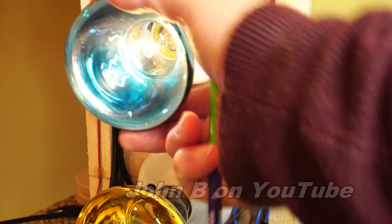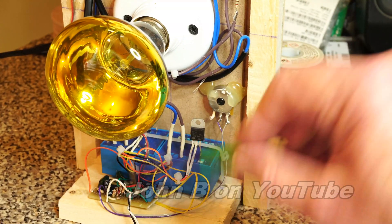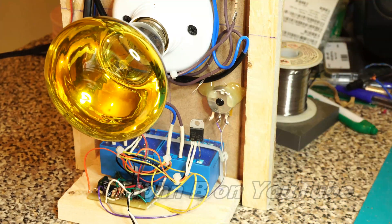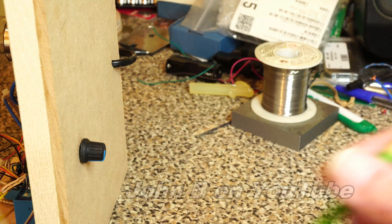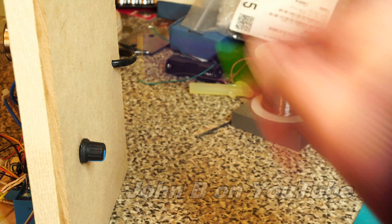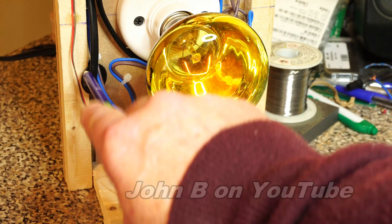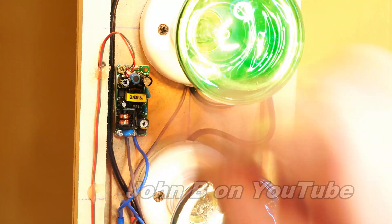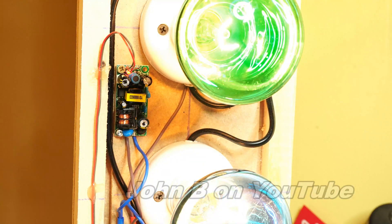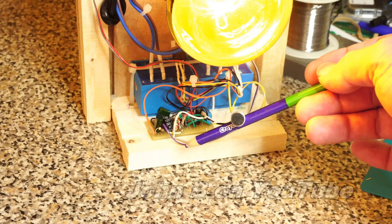Why this bulb moving is annoying — you'll see when I put the front on — these have got to line up with the front. There's a potentiometer sticking out at the back, 470K, this potentiometer controls the sensitivity, and I've got the mains coming in over here, protected with a 3 amp fuse. Didn't have any strain relief, so I've tied a knot in the cable. These cheap power supplies from eBay actually emit quite a lot of noise, so I moved that up here away from the sensitive microphone circuit, with the shortest lead possible.